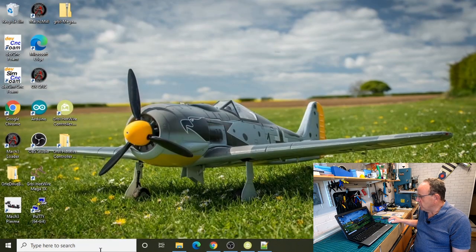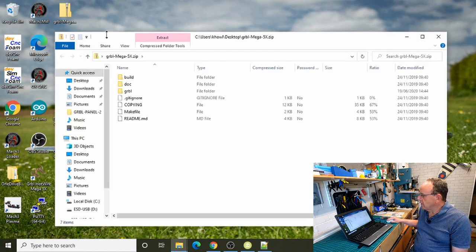Once you've got it installed, what we need to do is download the firmware. If you go onto the website, there'll be links in the description to download the firmware. I've just downloaded it and put it on the desktop here. Once it's downloaded, just unzip it. What we want is this folder here, GRBL, so I'm just going to drag that out onto the desktop.